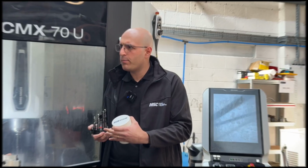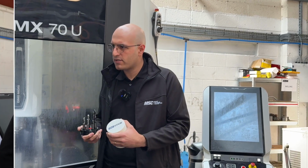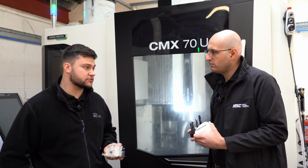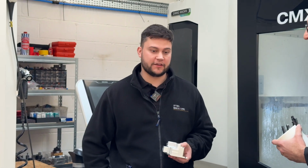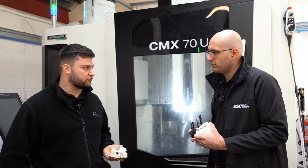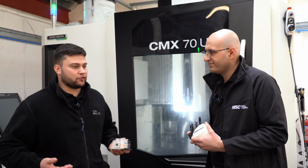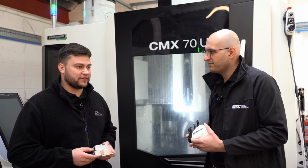Can you tell me a bit more about the engineering support that you received from MSC? Well, as I say, we were approached initially by you guys yourselves and pointed in the direction of these tools. So the first questions we had is, how will they perform? What's the technical data on these tools? Are they comparable? Are they worth testing? And the support that we had initially was that we were doing some stainless steel at the time, which is particularly a nightmare to cut at the best of times. And the support has been brilliant in terms of speeds and feeds, depth of cut and how to run the tool and get the most out of it. Every tool has got its best material to cut, so with the Edge being so variable, to get the ideal data is a great place to start and work from there.